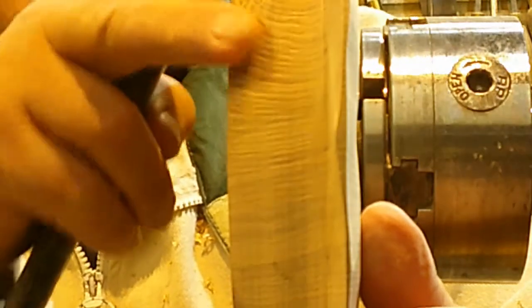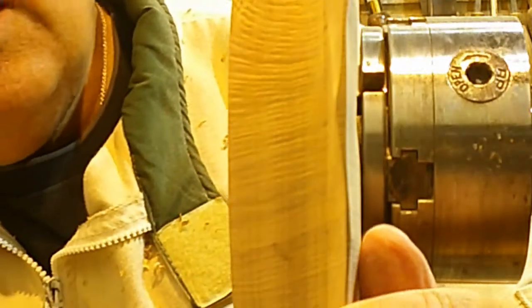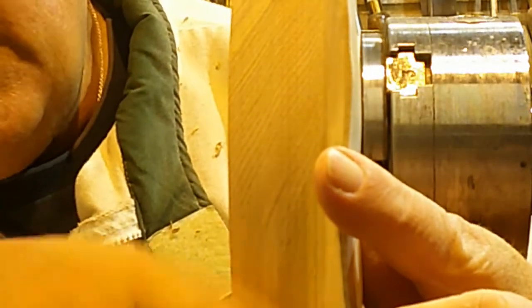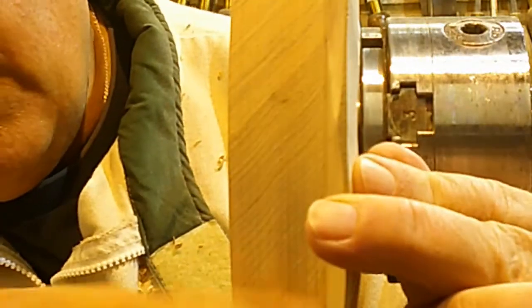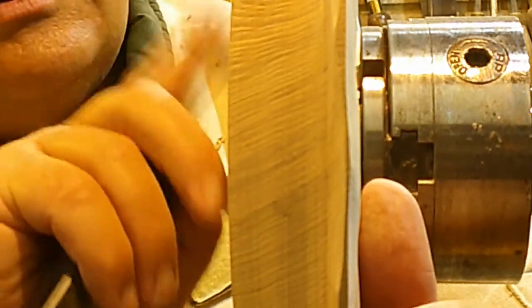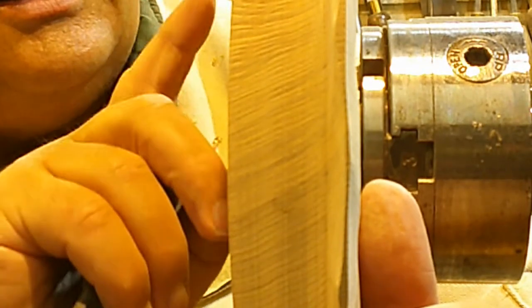So what I'm doing now is sanding the bowl down on the machine, and I'll hand sand it just to get all the last scratches out. When you come across that piece with the grain it's quite easy to sand across there, but when you get in there and you've got to go with the grain, you've only got that tiny little piece and you're just going back and forth - that's quite difficult to do. But when you are going with the grain it can be done quite easily. So I'm just going to sand it all down, apply sand and sealer, and wax, and then I'll be finished on the back.